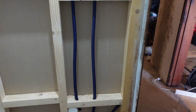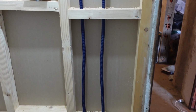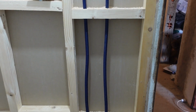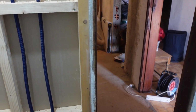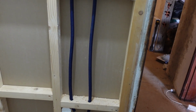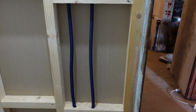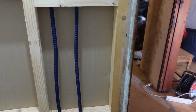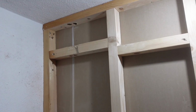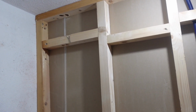Yeah, I'm just going to see what sort of wire we've got and how much we've got, because I don't want to cut it too short up at the top. I'm thinking of just leaving it until I talk to the lecky, see how much he wants up there, and then either leave it with no wire in, or leave him a load up there and just reel the one down for the socket. The one for the towel rail, I haven't fitted an outlet box yet. I don't know what sort of box it'll have on it, so I'm just leaving that as is. It might just be a wire into the wall with a connection there. I don't know, I'll have to have a look and see what sort of heated radiator we can get. They are a little bit nearer the wall than what I anticipated, but yeah, there should be enough there to get a bend just to go down and through this wall.